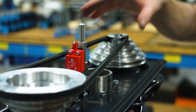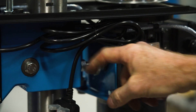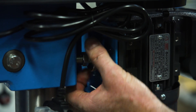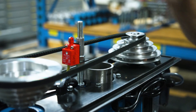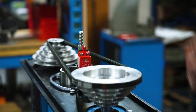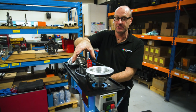As you can see here, it's been tightened excessively and there's not much play in it. What we need to do is slack the lock nut — you can move the belt adjuster in and out to get your tension. With it right in, it's very loose, so that's too loose and will cause slippage. We can unscrew that to give us the right amount of tension — somewhere around here is probably pretty good because it will still grip the pulleys okay.